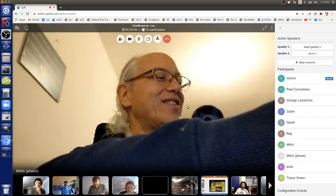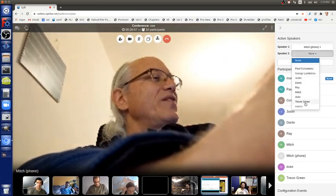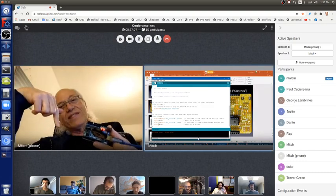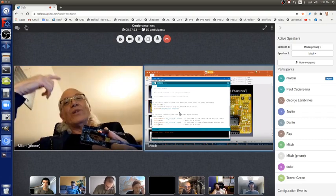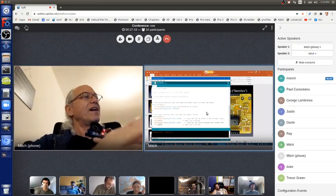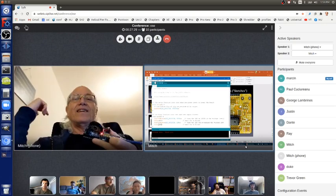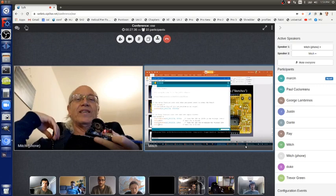So let's go back to here and change the delays to be within that range. If I make both of these 10, then it's on for 10 milliseconds, off for 10 milliseconds, on for 10 milliseconds, off for 10 milliseconds. That's 20 milliseconds total. So that means it will turn on and off 50 times per second, which is within the range of human hearing. And you'll be able to hear that if I hold it up to the microphone. So let me go back to the upload button here and do that. And then once it goes through its very slow compiling, it'll do a quick upload, and then you'll be able to hear that.